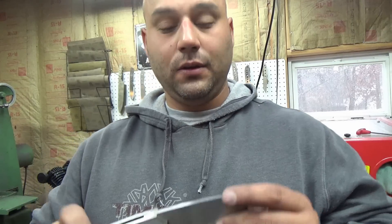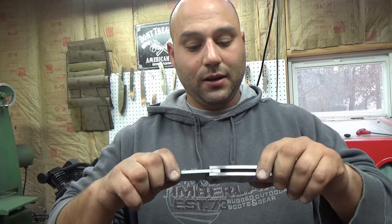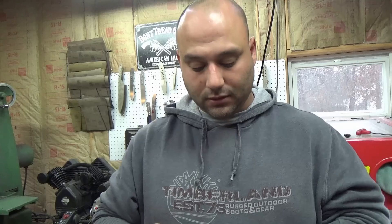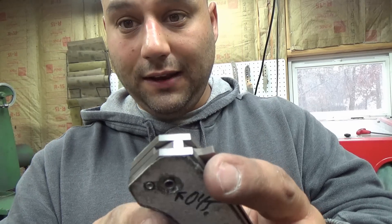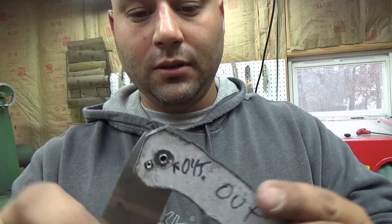This is how we're looking at the 120 grit stage — basically all I did was get rid of the 60 grit scratches. Now before I go into this, when you're doing the spine, because there is no lock on the knife, you have to make sure you're holding it up against the stop pin. Don't let this hand go limp and then try to profile it while it's wiggling around. Hold it tight in the open position and then do your profiling. Otherwise you're going to have dips and waves and it's going to look goofy. It's little detail areas like this that are now flush. This one's still going to get done so I have a bit more work to do. Even back here where the lock face is — the lock face is going to be cut a little shallower than that. We ground into the lock face just a little bit, no big deal, I accounted for that. Make sure you have room before you do that, otherwise you can start all over again.